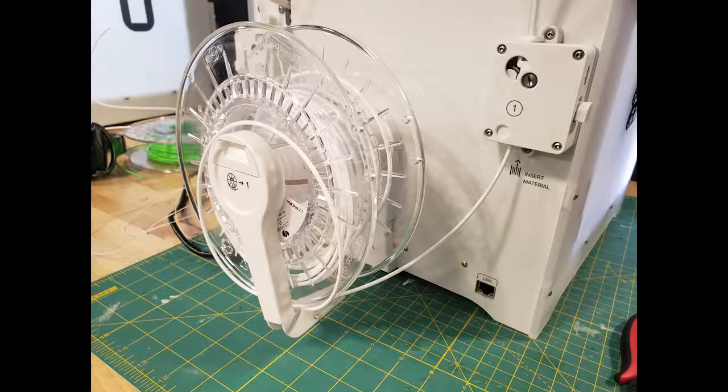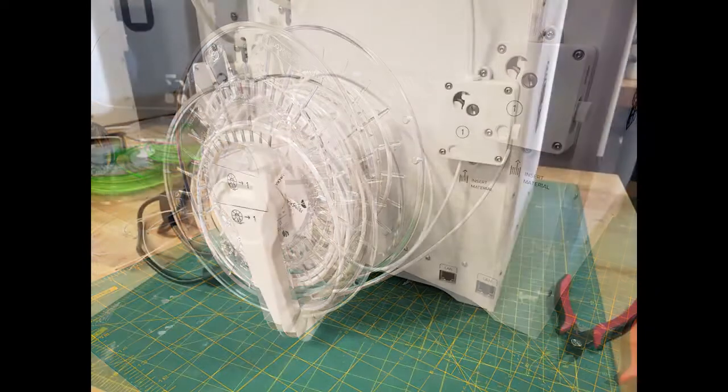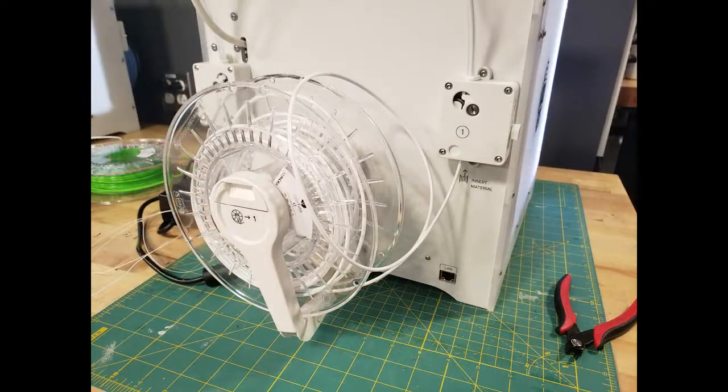Now that we're familiar with the back of the 3D printer, let's get into the first thing you should do when checking to see why a 3D printer is not extruding, and that is checking to make sure the spool is not tangled. Here are just two examples of a tangled spool. You might see different versions of this, but the point is the spool is not normal, and if this continues, it is going to cause problems.